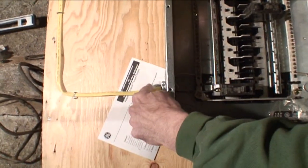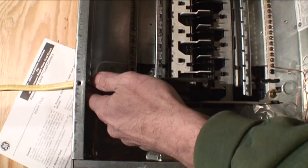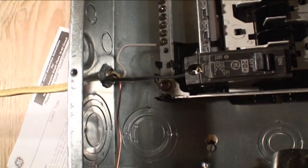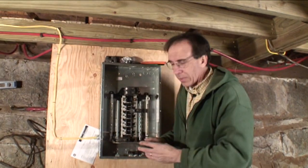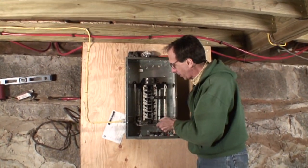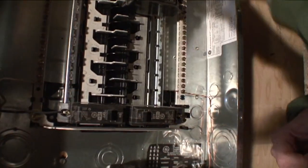The Romex has insulation on it — we're going to take some apart in a minute. We cut that back to just beyond where it comes through; we don't need that inside the box. Then we'll go right along here and put a circuit in, working off either side, and we snap in the circuit breakers as I showed you last week. They snap onto the bus bar like that, and we'll just fill up the entire box.